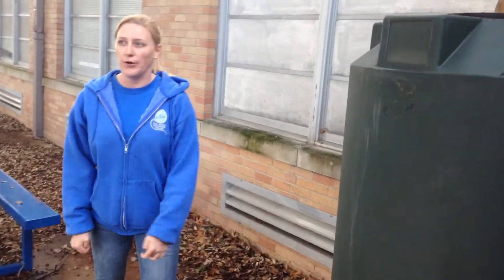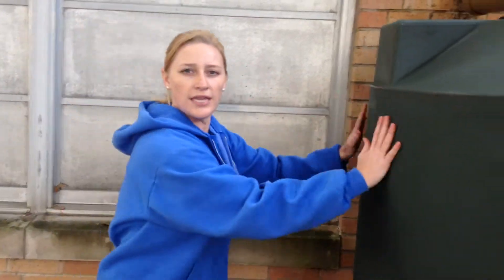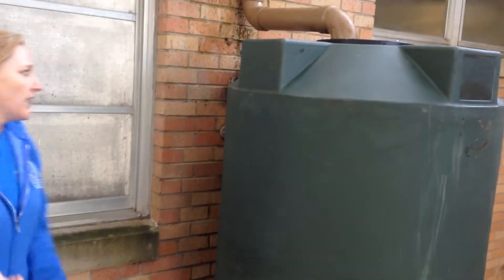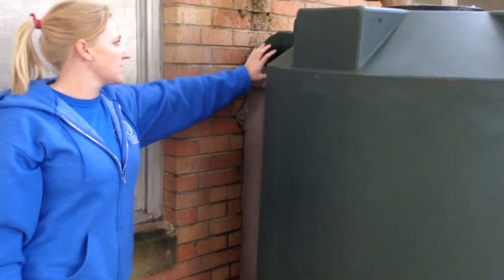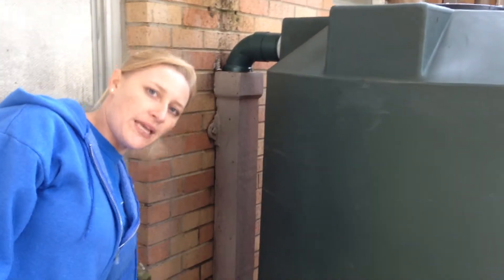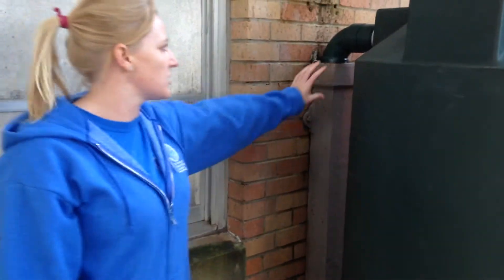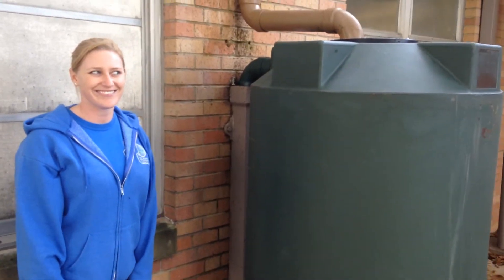Lastly is the overflow. You're catching all of this roof space into this one little tank, and when your tank fills up, that water has to go to the overflow. This one is on the back — you'll either have a pipe coming in and out, so inspect that and make sure it's clog free. This one is a little unique; it's going right into an existing drain. That's your rainwater tank in a nutshell. I'll see you next time, bye!